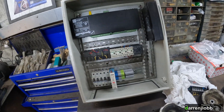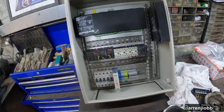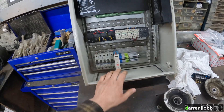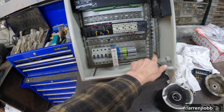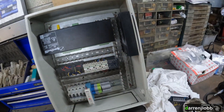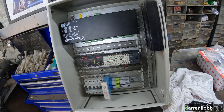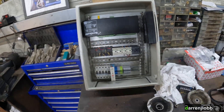It's all on DIN rails so it's all movable and changeable in the future. We've got the actual dyno controller at the top, the support device is SP6, and we've got a row of contactors and relays — that's for stuff like the fan, the extractor, the airbrake solenoids, all the outputs basically. There's a 12 volt power supply at the bottom for control stuff, breakers, and all the cables coming in through the terminal strip at the bottom. Then we've got the computer there which will run the dyno software. The only thing I haven't quite squeezed in yet is the higher output power supply that drives the fans — they take quite a lot of current so I put them on a separate power supply.